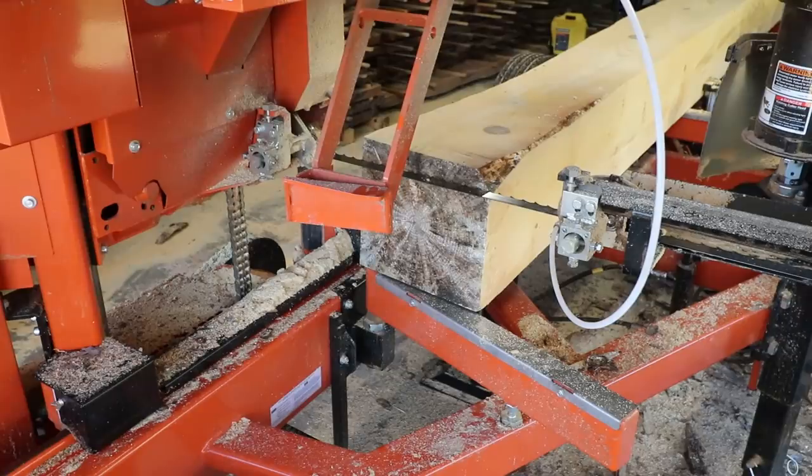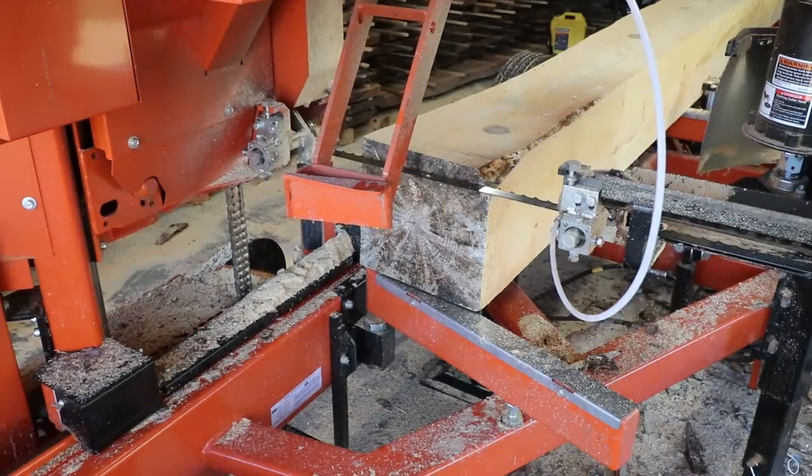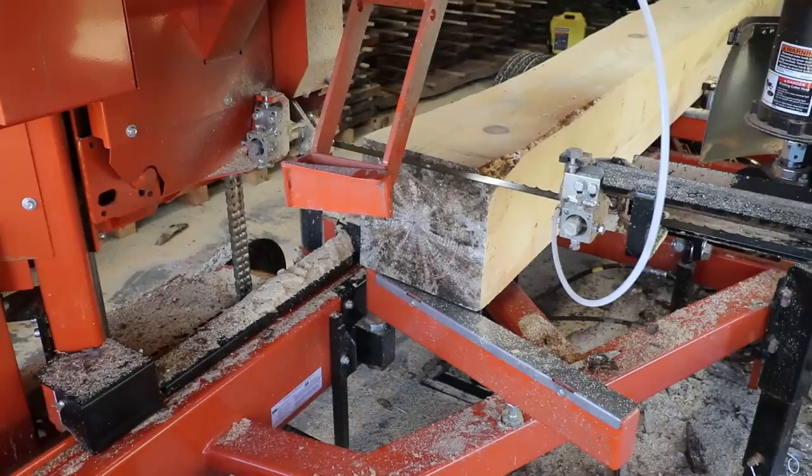That's our 4 inch mark right there, 9 7/16, exactly 4 inches up from where we started from. And if I go up one more click, I think, let me see, we'll get one board out of this. We'll do a skim cut here on top. Probably take off maybe 1/4 inch. And then we'll come down and do one board cut, and then this side will be done.